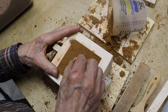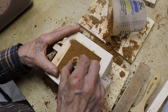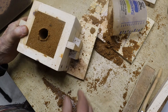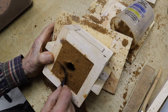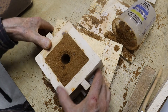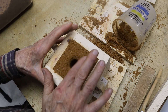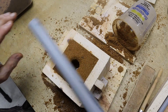In order to get the combination sprue and riser out, I wiggle it around a bit and it should come right out — and it does. I want to make a little funnel-shaped depression, so I'm going to scrape out some sand around that, forming a chamfer. In doing that, I loosen the sand a little bit, so after I've done this I will compact it with my fingers a bit. I'll raise the sand up just a bit and hit it with a roller so when I invert it, it'll sit flat.